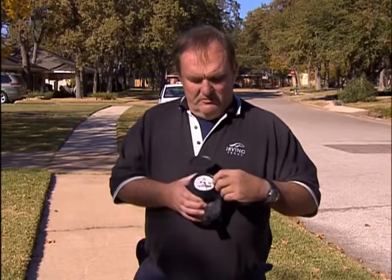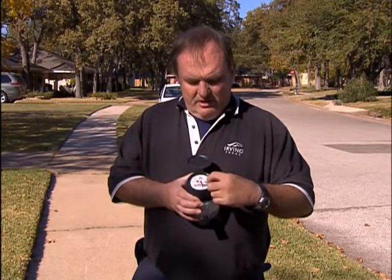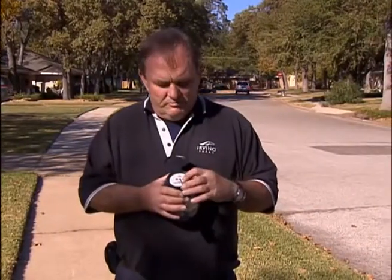The face of the dial is in one gallons, represented by the fixed zero with a black background and white letters. The other two black background with white letters are the 10 spot and the 100 spot. For personal daily use, those are the ones that you'd want to read to determine how much water you probably used. However, when it's irrigation time, that's when you probably want to move over to the thousands.